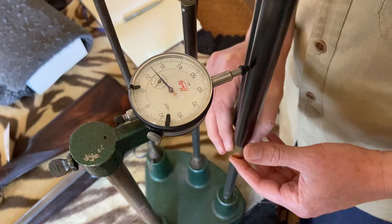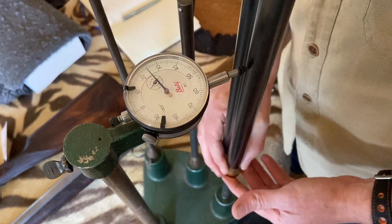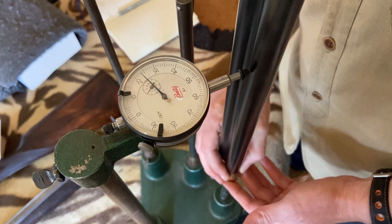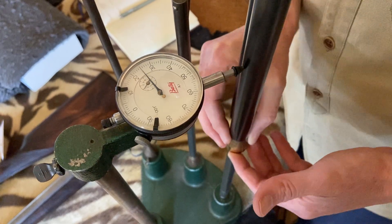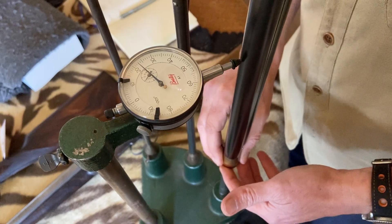There's a reason for that: good material will withstand the proof test when it's thinner, and inferior material will fail the proof test even if it's very thick. So the proof test allows for better materials to work within the tolerances that they can demonstrate strength.